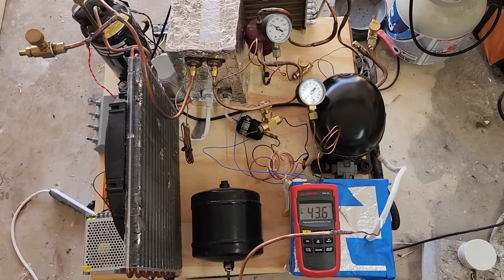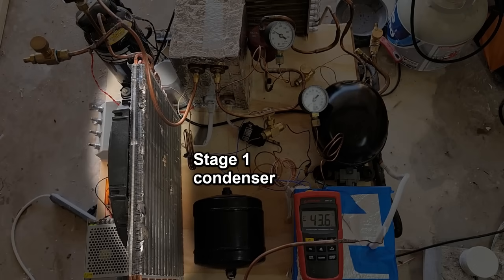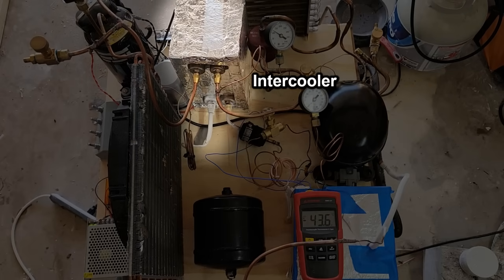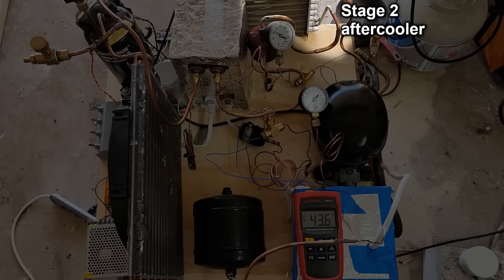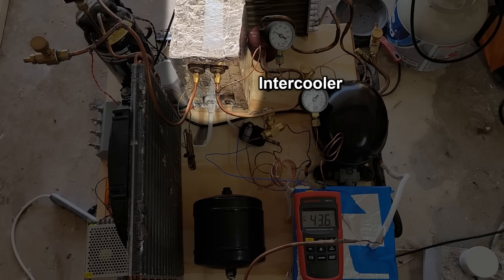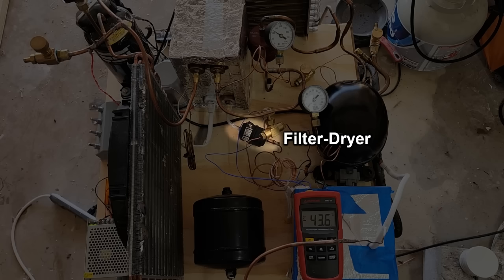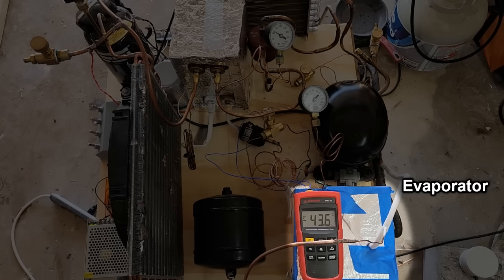Here's a look at the whole system after rigging it up for the first stage. Things are a little messy, but I've highlighted the components to clarify what's going on. We have the first stage compressor, first stage condenser, first stage capillary tube, the intercooler which is the first stage evaporator — at the bottom you can see the inlet line is iced up — and the first stage return line. Moving to the second stage we have the compressor, the aftercooler, the oil separator which is the crimson cylinder hiding behind the high pressure gauge, the intercooler which is the condenser for the second stage with the inlet on top and outlet on the bottom, the filter dryer, the capillary tube with the adjustment valve, the low pressure side gauge, the buffer tank, the evaporator which is inside the foam box that the thermometer is sitting on, and the return line.